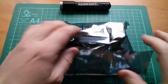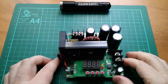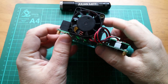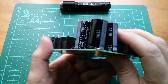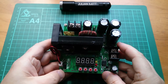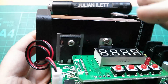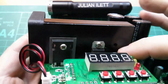A module. It's another Ming-He power supply. It's a Buck power supply, I'm pretty sure. Or is it Boost? Actually it might be Boost. But it's got a heatsink and a fan. Hmm, 160 volt capacitors on the output, so it's definitely a Boost converter. I'm pretty sure I remember reading that this thing can put out up to 120 volts DC. So on the heatsink there is a big MOSFET, and this other device here — even though it's a three terminal device — I really should know that it's a diode.